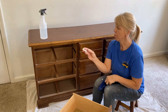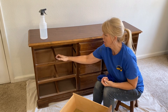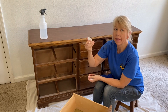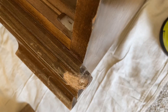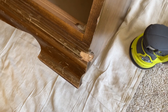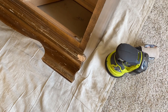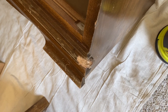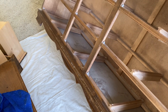You may also find when you remove the doors that one of the plastic slides — a guide that goes along the piece so that the drawer moves smoothly in and out — has fallen off. This would be the time to reattach those. There's a piece here that almost looks like it got chewed up by a dog. I'm going to go ahead and sand it down, round out the corner, and do the same on the other side so they're as equal as possible.